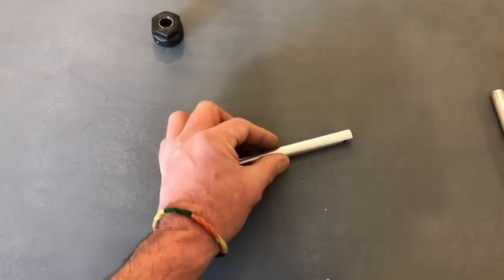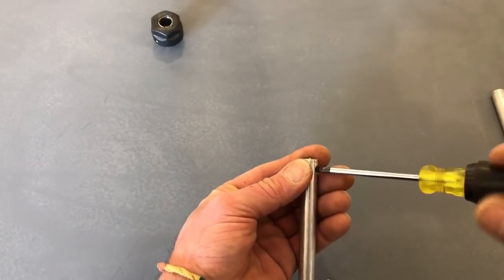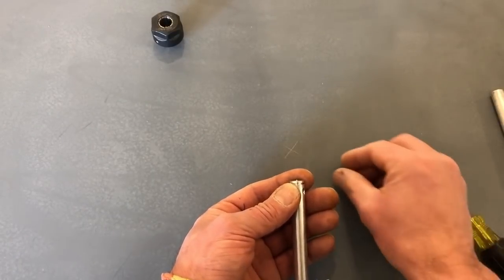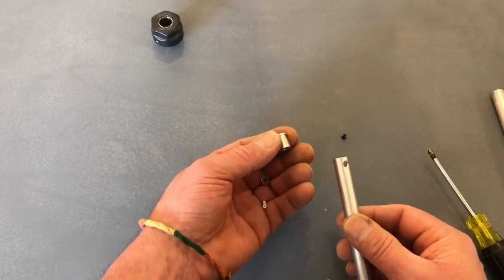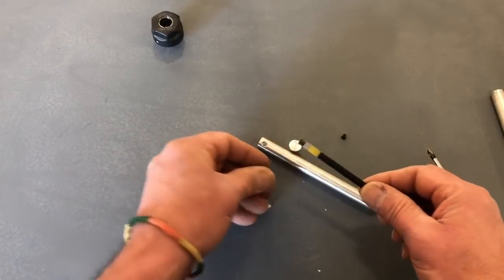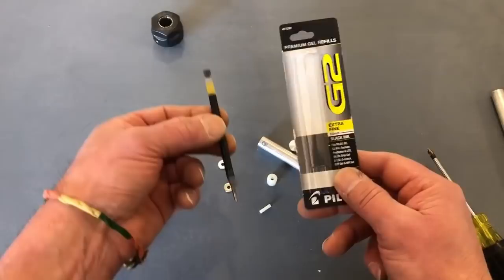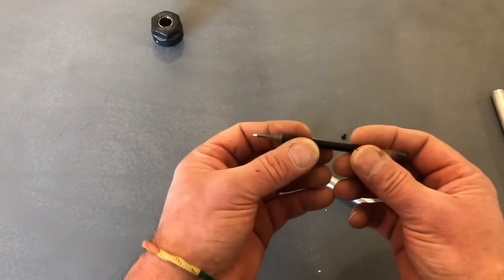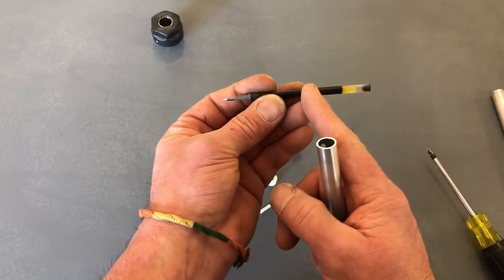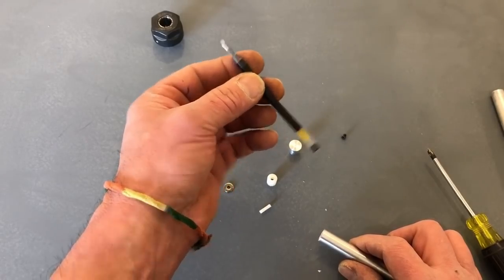Let's get into the construction. I started with a piece of half-inch OD aluminum tube from Lowe's — readily available in the hardware department. The important part is it's half-inch OD, which fits right in the collet. I machined this little pen tip — it's simple, just an insert that slides into the aluminum tube and is super glued in place. The most important thing is the shape — you want to make it like a cone shape so you can see more clearly the tip of the pen when it's in the machine.